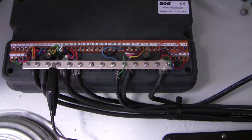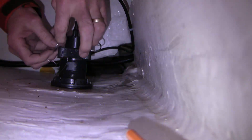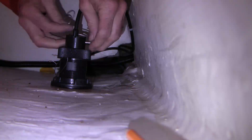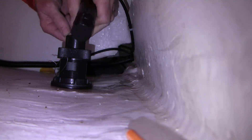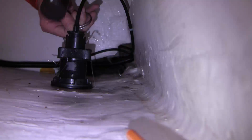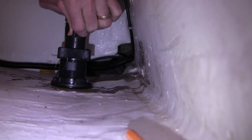At this point I'm going to take the sensor out and have another look at it. We're going to pull this out with the boat in the water — make sure you have your blanking plug all ready to go in, and it's clean and free of debris, and make sure the seals are okay. First you take this split ring off and then this part comes up. We're just going to pull the transducer out and replace it with the blanking plug — make sure you know which way it goes in. Pretty simple if you're prepared.